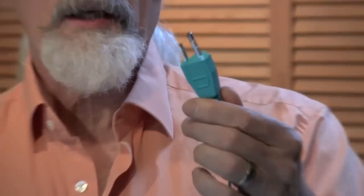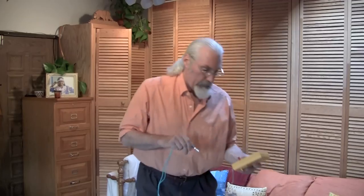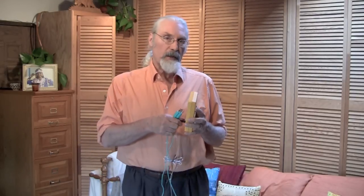In that case you'd typically use the electrical ground of the building. Here's a grounding cord — this green grounding cord is connected to the grounding prong, which you insert into any grounded outlet, and the other end goes into the meter. Instead of going to the earth, we're now using the building's electrical grounding. The electrical grounding system is close to zero volts in most cases, but not perfect — you typically lose accuracy, usually within about 0.2 or 0.3 volts rather than 0.1. But it gives you an idea of how to take a measurement when you cannot easily get to soil outside.